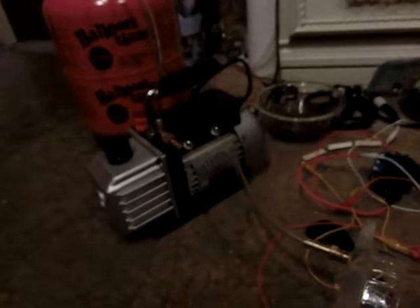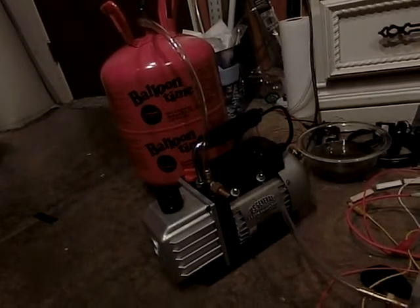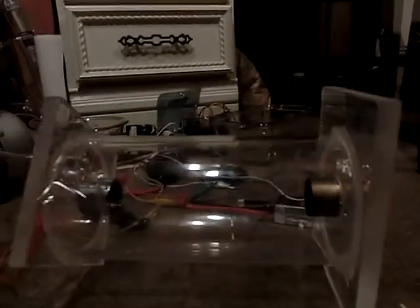This is the positive — the circular thing is the positive. It's actually hollow. And the wire will be the negative. I am going to hook it up to this single stage vacuum pump, and I'm only expecting to get around probably 50 pascals. I'll backfill it with helium gas for an increase in the mean free path, and hopefully I'll be able to show you. It's being driven by a flyback driver running about 12 kilovolts.